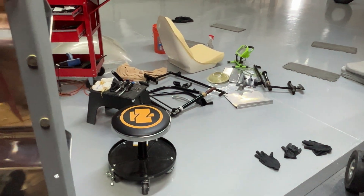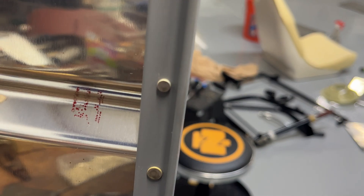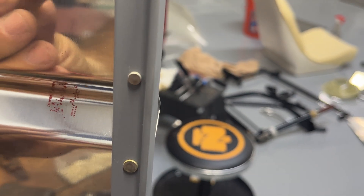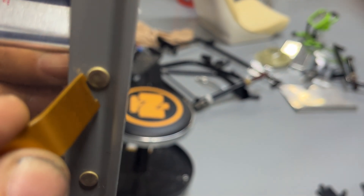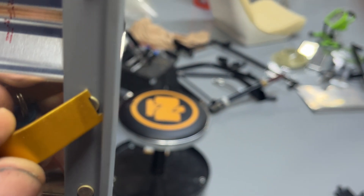I'm going to put this go/no-go gauge across a good rivet. You stand it up and it should just go over — let me show you right here so you can see it a little better. This one's too flat — the go/no-go gauge barely slides in there and it's too wide, as opposed to a properly set rivet which is inside the confines of it and just perfectly fits the height.